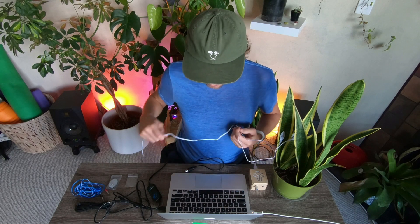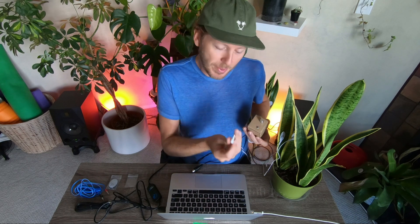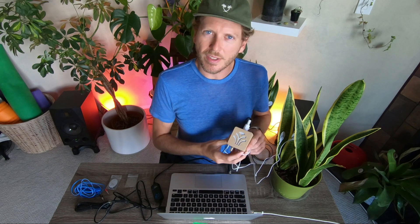Now we are all hooked up. I'm going to connect this right into the front of our MidiSprout, and then it's just a matter of turning this knob. Here's a little secret about this knob — it's not just an on/off knob, it's also a sensitivity knob. When you turn your MidiSprout on, right when you feel the click, that's when your MidiSprout is most sensitive. As you turn the knob farther, it's less sensitive and you won't get as much of a signal.